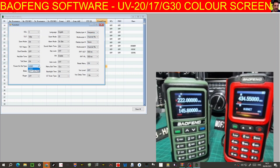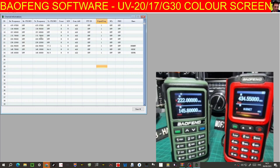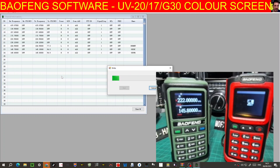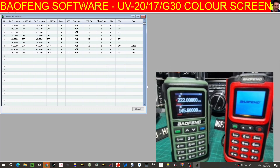If you look through it, it all seems fine. You can save it somewhere if you really want to. Then just write that to the radio. There's more settings if you want to look — Help, About, version 1.1.8. Then just write to radio. If you get an error, just read and then write — I find that fixes it. Now if we go to the B band it already says hub network, and on the A band the frequency shows.